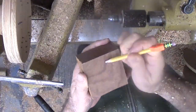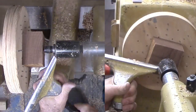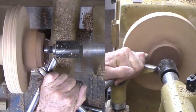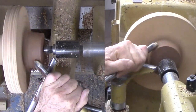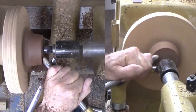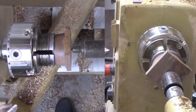For the cap, I found a small cross grain chunk of walnut. After finding center, I am pressing the wood against my spike faceplate. However, my wood is smaller than the spike diameter — no problem. I often use the face of chuck jaws, so this is the same setup. Just rough it round at least on one side. I do not want to get too close to the spikes. Then, of course, a tenon.